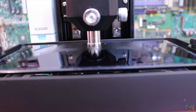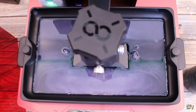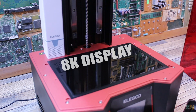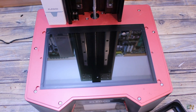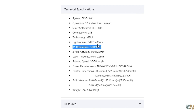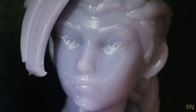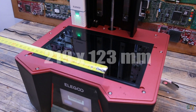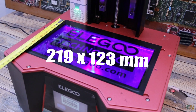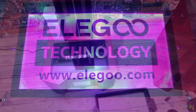So while we get the results, let's talk a little bit about this new printer and all the specs. This printer is quite impressive. The part that calls our attention is the 8K resolution display. That resolution is actually 7680x4320 pixels and that results in perfect details — I can't really see any layer line in the results at 0.05mm layer height, so totally perfect details. The printing area is 219x123mm, so more than 26,000mm², and with a resolution of 8K that equals to more than 1000 pixels per mm², with a pixel size of 28 microns.